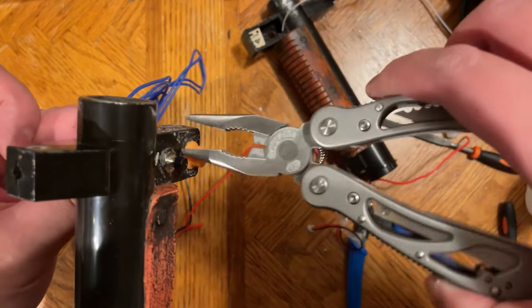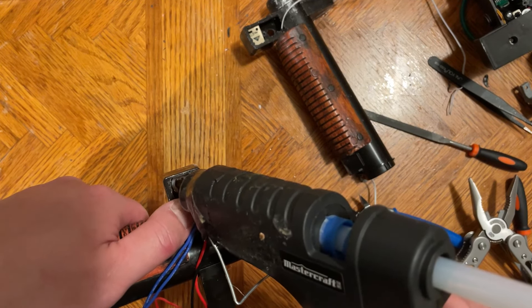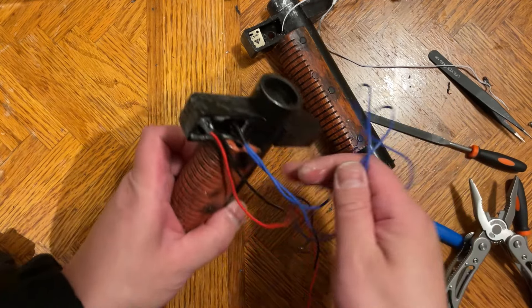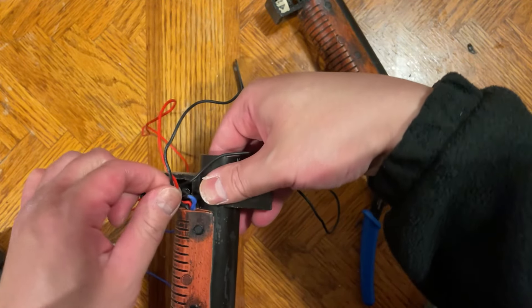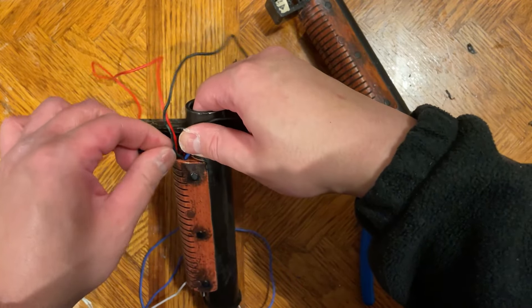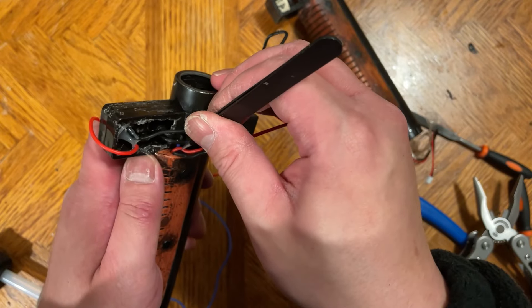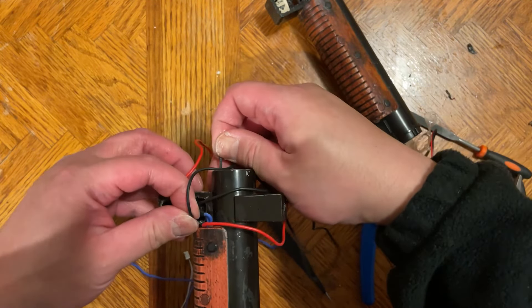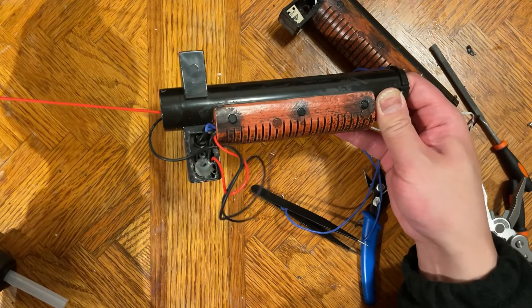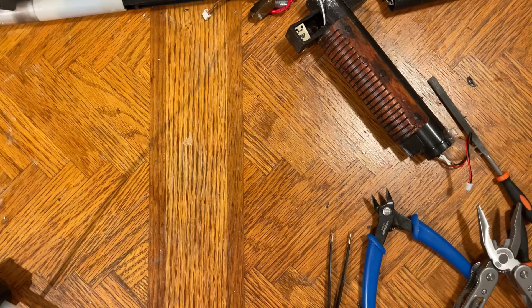Next, let's do the push button: take off the nut, insert it from the bottom. If it's a little tight you can always just file it down, or just turn it and it'll thread through the plastic. Depending how much you want it to stick out, you can remove the spacer. Then from the other end just secure it with the nut. Then put in the LED — you can add a dab of super glue or hot glue — so that goes in all the way.